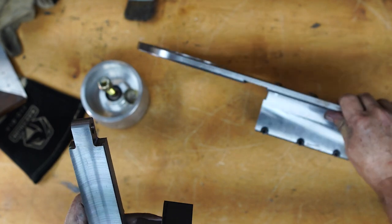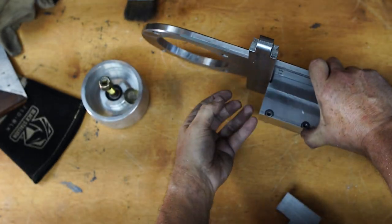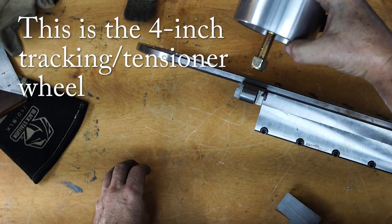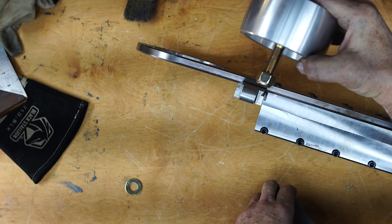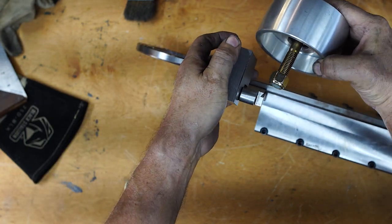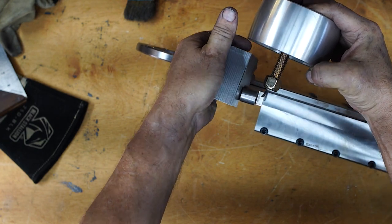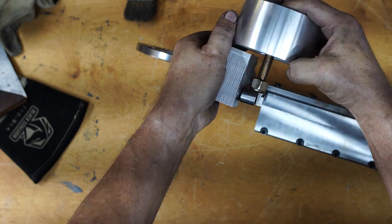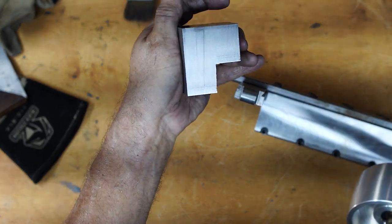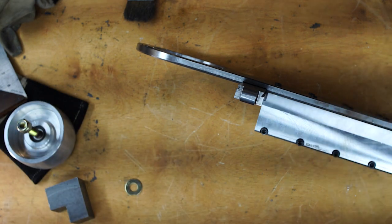That piece of metal is part of the belt grinder I'm making. Here's the belt grinder main plate, and this is a tracking arm with a dovetail on it — it slides in there and will be held up by a gas strut. The wheel mounts here, that's where the belt's going to run around this side. This piece of metal makes that interface. The L shape is so it can mount approximately like that; this part will get cut away so it mounts right directly on top. This will mount here and give me some tracking adjustment back and forth — this wheel goes up and down just about an eighth of an inch to allow tracking of the belt. So that's what that hunk of metal is for. Now that this little bandsaw side project is done, I'll get back to building the belt grinder. Thanks for watching.